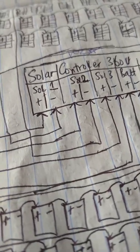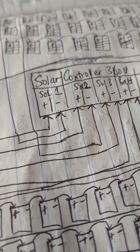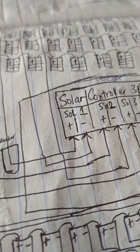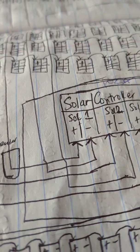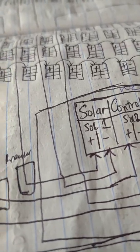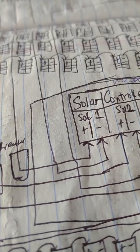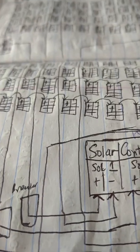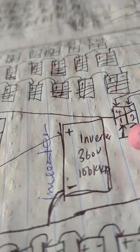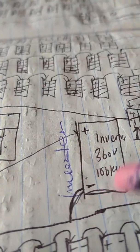Good batteries read 12V to 13V each. So 30 batteries in series should read about 390V. You read it and confirm. If the inverter input should be 360V, you set it to 360V, then connect to your inverter. Check the parameters of your inverter — the inverter is 360V and the 100 KVA. If it's okay, fine — you then connect the battery power bank to your charge controller.